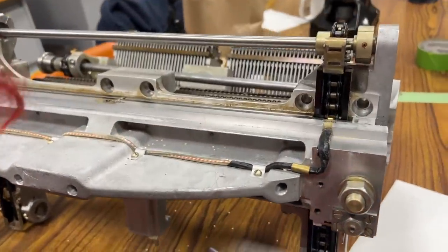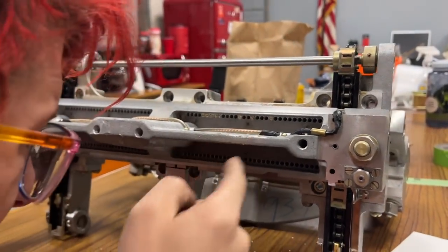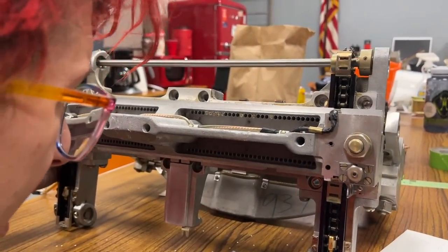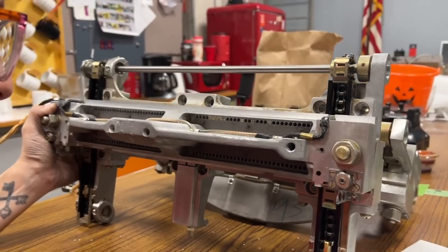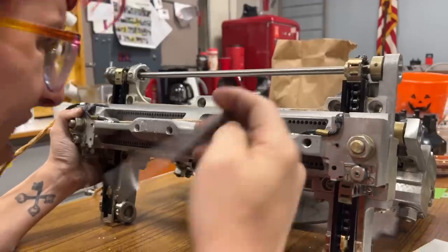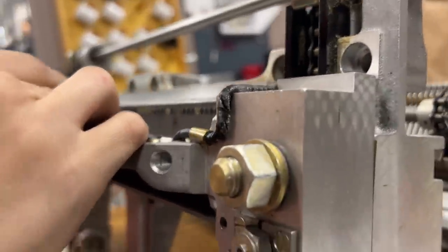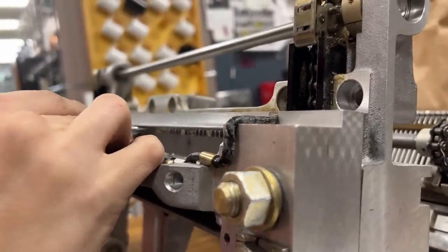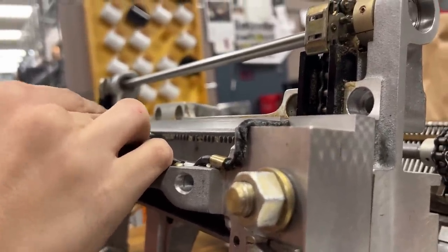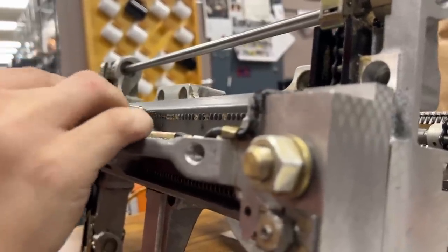So what we found is that this entire half of the machine up here is really angry. And I don't know that replacing the pins is either possible, nor will it help. I've got one end of that one. These holes are where the punched chads are ejected from the machine, and many of them were completely clogged with paper. This must be why the punches are bending in the first place.